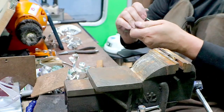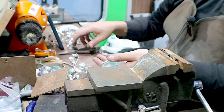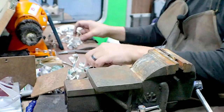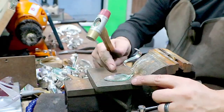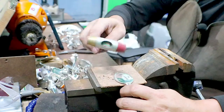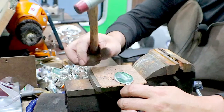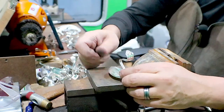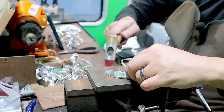This one looks like I already bent it. And it's flat, so I probably already did. So I can see the middle is bowed in and the outsides are up. So first thing I'm gonna do is strike it in the middle. So I'm going the middle to the middle back. From here to here in the middle. So that gives us a bow kind of going flat.